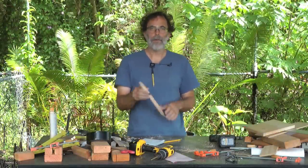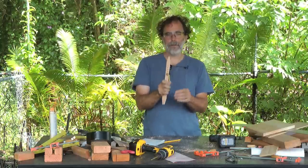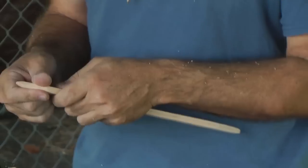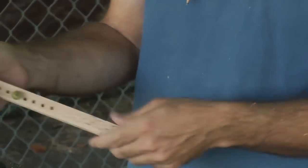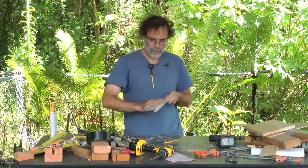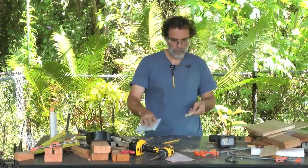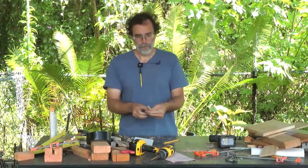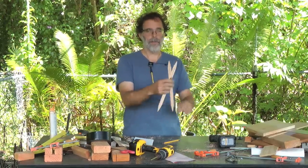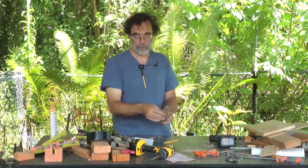So now all the tape's off, and we don't want to touch these points again. You can check and see how well they're lined up. If you don't like your point, you can tape it again and sand it again. But don't try to sand this without putting tape on it to hold it perfectly together. Then very gently, without touching the point, just sand the rest of the edges. So there it is — there's your proportional divider, ready to go. This is the end you measure with, and that's the end you plot with.